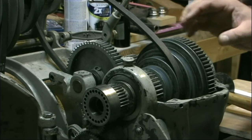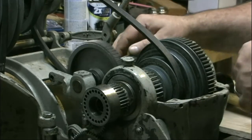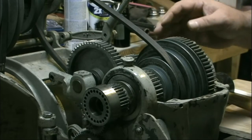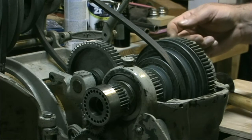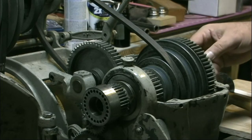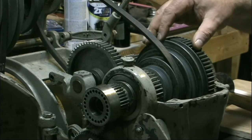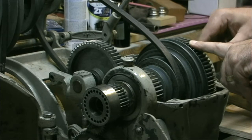Let me explain how this works. Normally with this pin pushed in and engaged to the pulley, and the gear set back out of engagement with the spindle, the lathe is in direct drive — as the belt spins it just spins the whole spindle. The idea of the back gears is to slow the spindle down further, giving it more torque so that you can take heavier cuts or cut larger diameter metal.